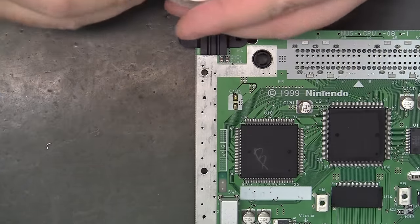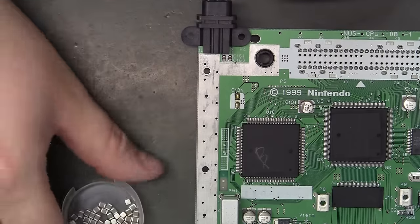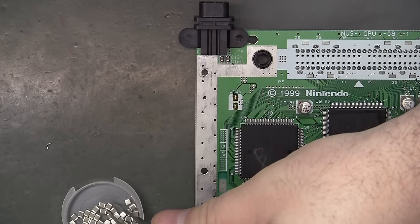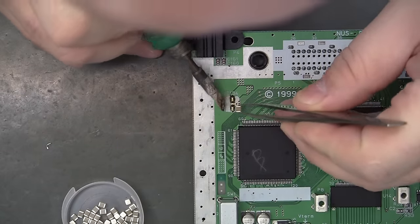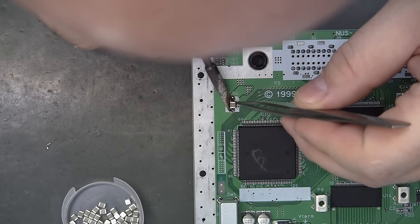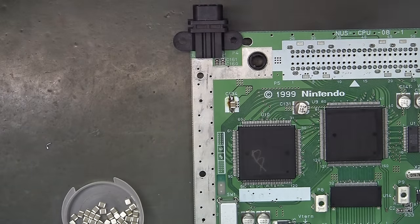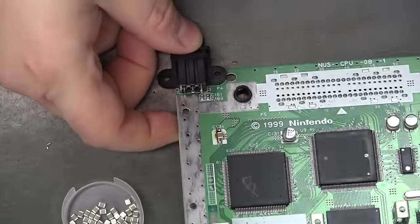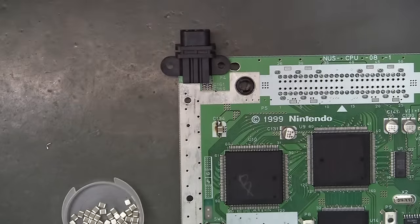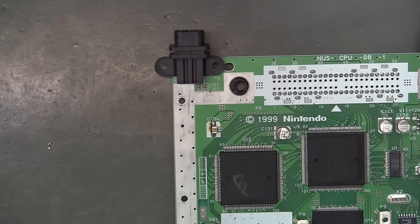And there's my 100 microfarad ceramic capacitors. The 68s are 10 volt. I believe these are at least that, if not 16. Some tweezers here to help. Quite nicely. And that will never leak and destroy traces. So I'll press on and then do some more of them.